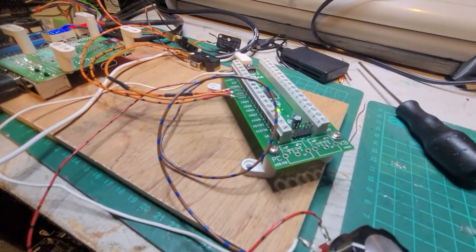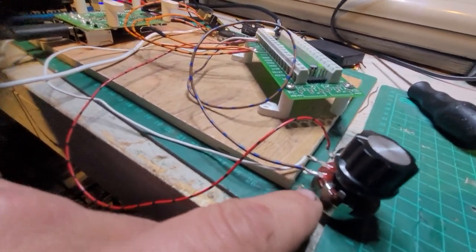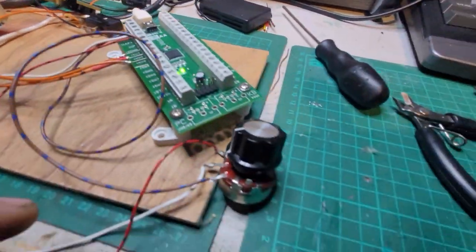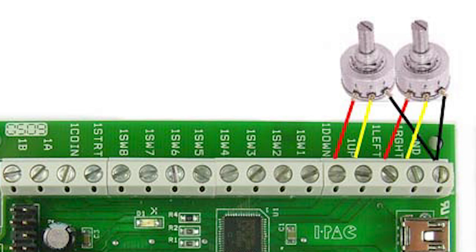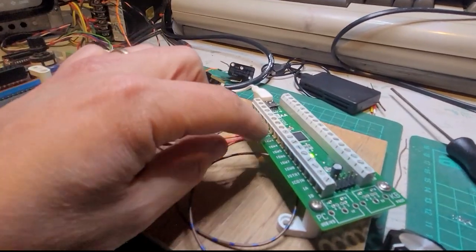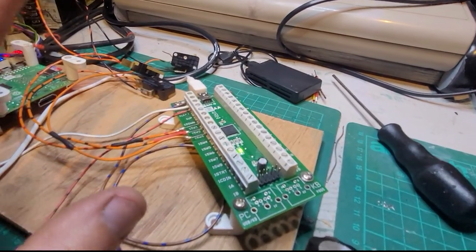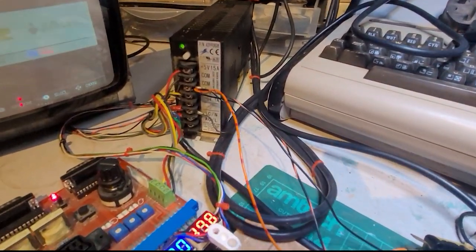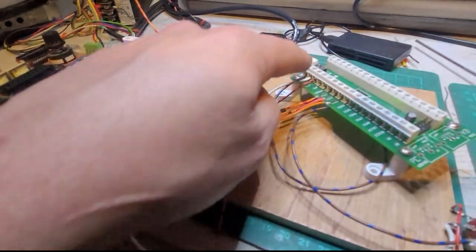For the APAC wiring, here's the recommended setup for the pot: one end goes to ground, the middle wiper goes to right/left (you may need to invert these in MAME depending on the game). I've also connected all the buttons to switch inputs 1, 2, and 3 — it doesn't really matter which inputs you use here as we'll configure them in MAME afterwards.